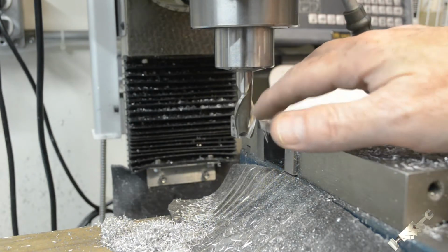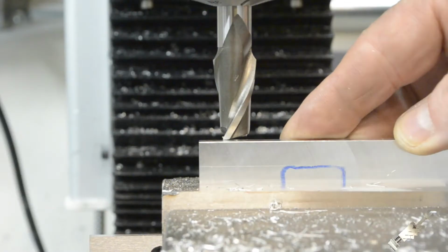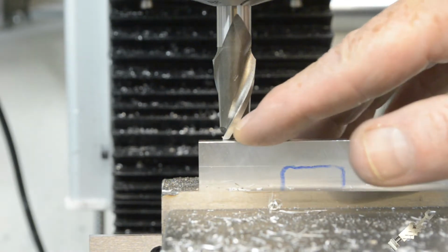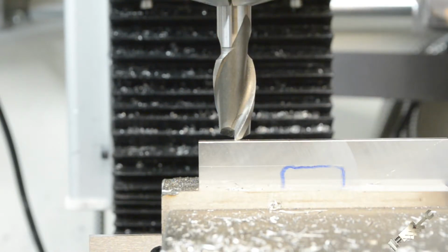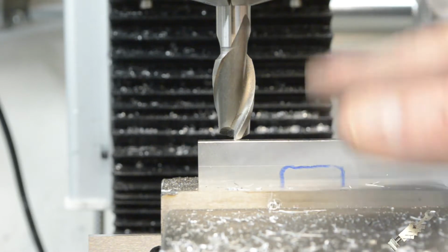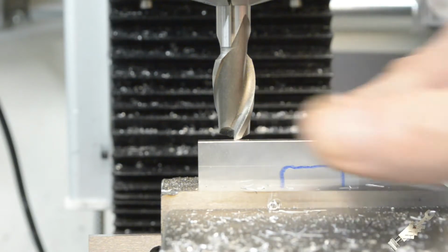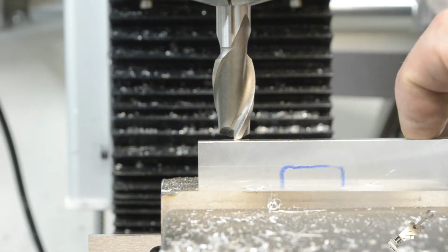Alright, so we'll get that deburred and flip it back up in the vertical position. It's just sitting on one parallel. I brought the mill down to it, and it just leaves the faintest scrape on the material. Okay, then I'm gonna zero out my digital readout on the Z-axis. See if you guys can see. So I'm going to come down 370 thousandths on this, and that'll leave me with a piece of material 1 inch high, and that'll be the largest dimension of the frame.